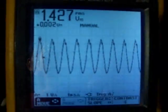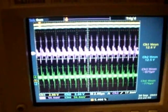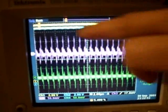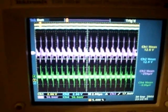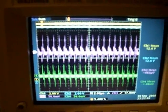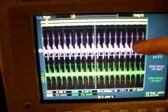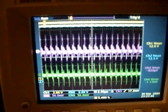This is what the load looks like on the Fluke — the negative is on one end of the load and the other end is positive. And this is what's on the Tektronix: the yellow line is channel 1, which is closer to the positive terminal; channel 2 is blue, which is further from the positive. Those will show the difference across the current sensing resistor at the positive terminal. Channel 3 is the purple channel for the load; channel 4 is green for the timer.